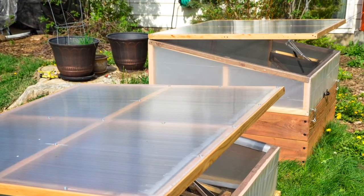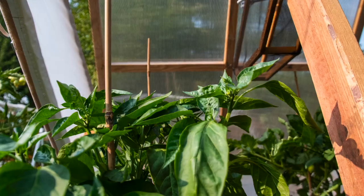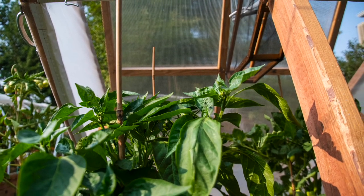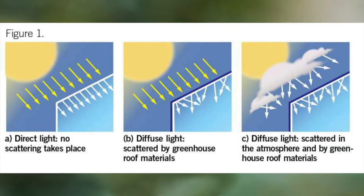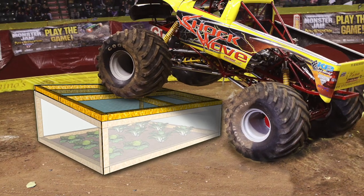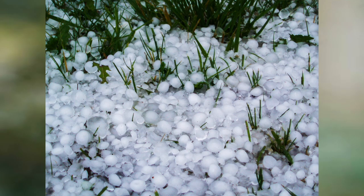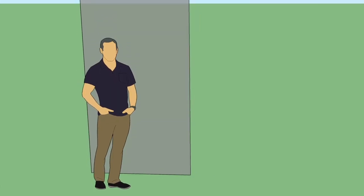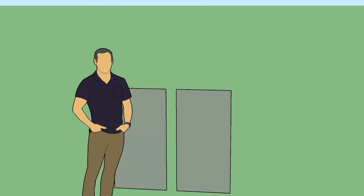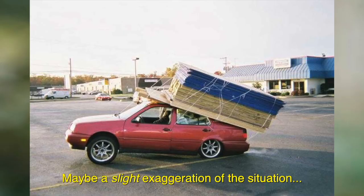The top panel is 0.236 inch — often listed as quarter inch — double wall polycarbonate sheeting. This material is lightweight and transmits almost as much light as glass. The hollow rib chambers in between the layers scatter the light rays creating a diffuse light that's perfect for plants. The best part is it's nearly indestructible and super strong, withstanding impacts so rain, snow, and hail won't harm it. Because I was building two frames at once I got a 4x8 sheet from Home Depot for around $80, but if I had to do it over again I think I would get 2x4 foot smaller pre-cut panels to make them a whole lot easier to transport.